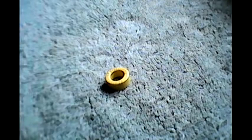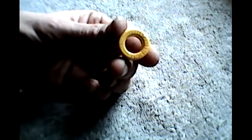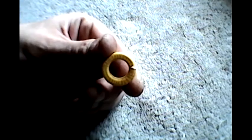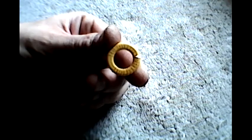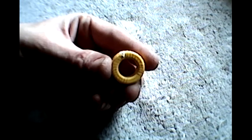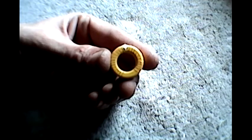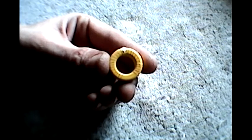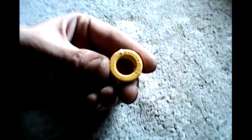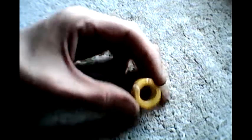Let's get started. What I have actually done previously to start to make this video is I've got a scrap piece of wire and I've wound it around the correct number of turns — I think it's 21 turns — just so I can measure the length of wire that I need. If you don't want to use wire you could use a piece of string to measure it. Because this magnet wire is rather expensive and I don't really want to be wasting it.